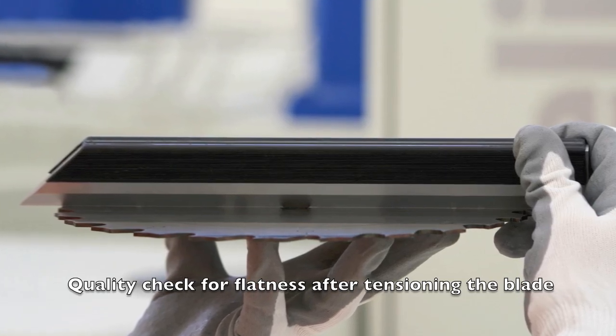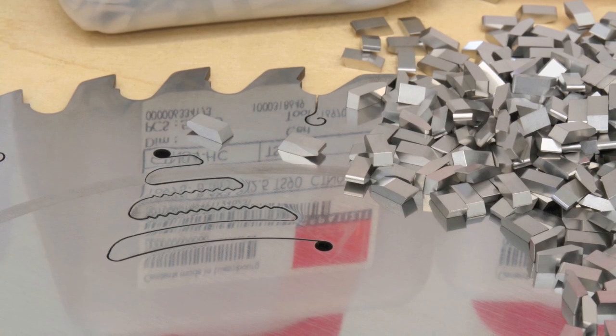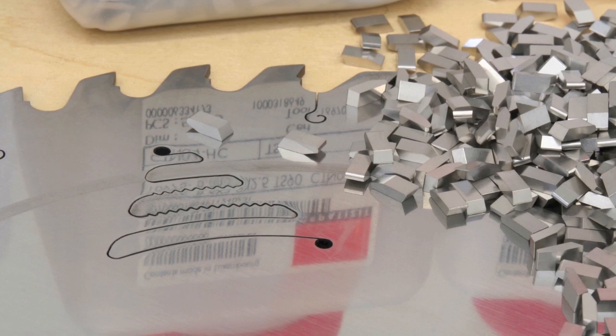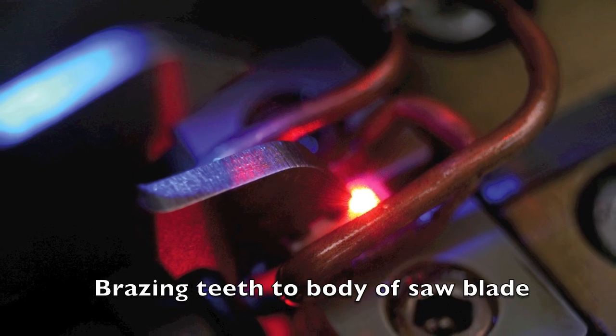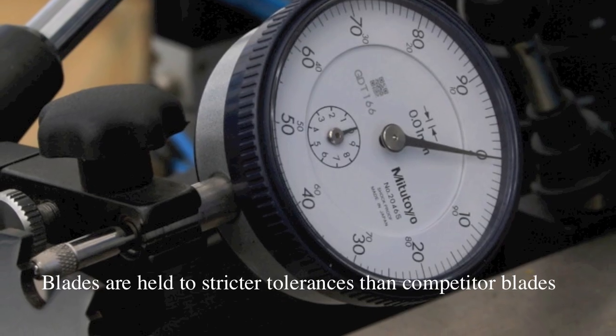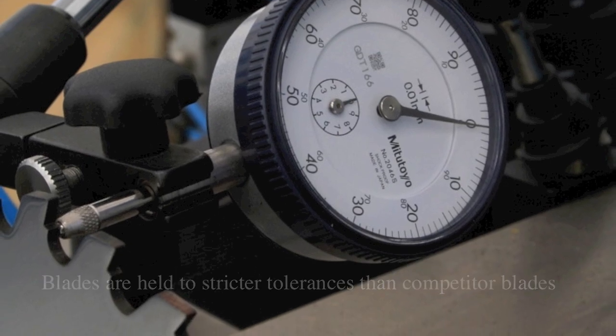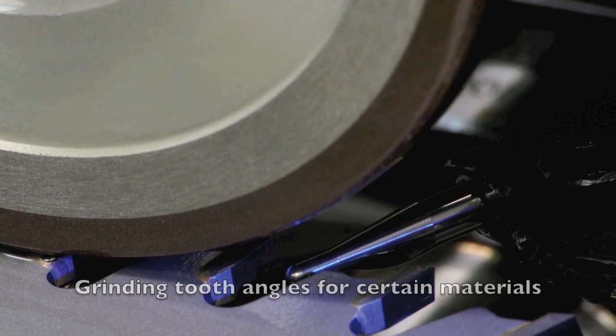This next step was my favorite — it was the tip brazing. It's where they apply the carbide teeth to the blade. It's an induction tip brazing that uses a silver-copper-silver method, and the machine skips every other tooth in order to keep the blade flat, which I thought was very interesting. It also has a slow heating and cooling method to keep the blade's strength and resiliency.